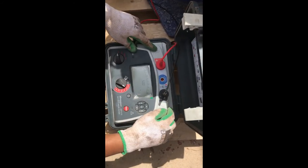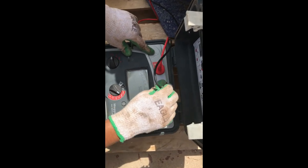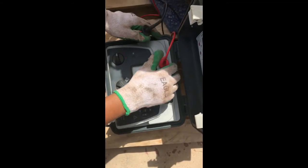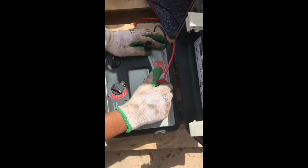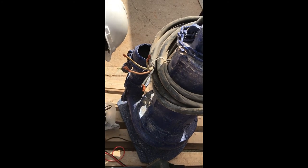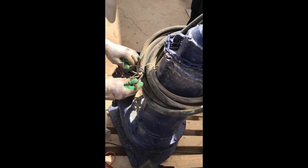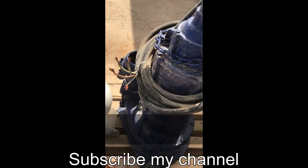Now the test is completed, so we are going to disconnect the cable. Just make sure once you disconnect the cable, you should put it with the guard — which means all the earthing current will be neutralized. Do the same here also. Touch all terminals with the earthing cable, so now the test is done.